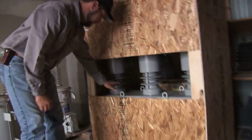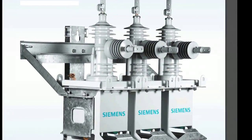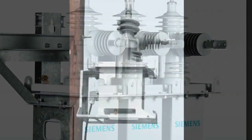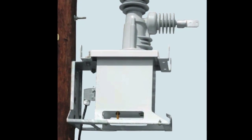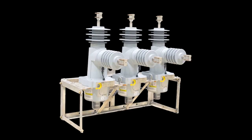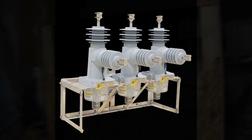What we call a triple single vacuum interrupter — it's kind of the same principle as the OCR, but it's got vacuum canisters inside. That vacuum canister is what breaks the arc when the contacts open. The Form 6 microprocessor-based control will operate this breaker.